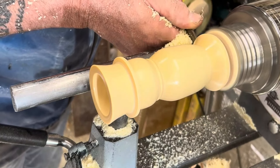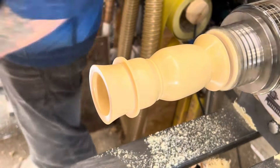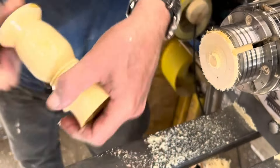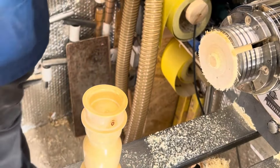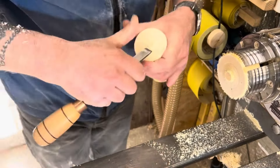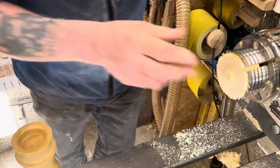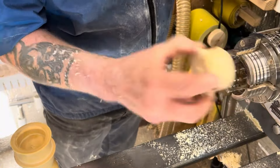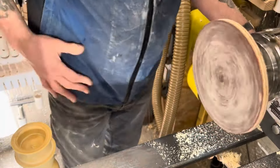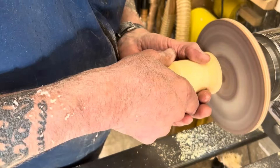The cherry will probably leave a little hole at the bottom, so I go right down to a little bit and then I'm just going to cut that off with a saw. Look at that finish — beautiful. I'm going to put my sanding disc on. I was actually going to cut it off with the skew, took a little bit off and thought — nah, that's too hard, too much like hard work. I'll sand it off. Quick little sand and it's done.